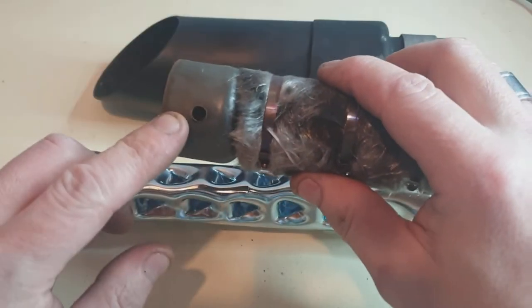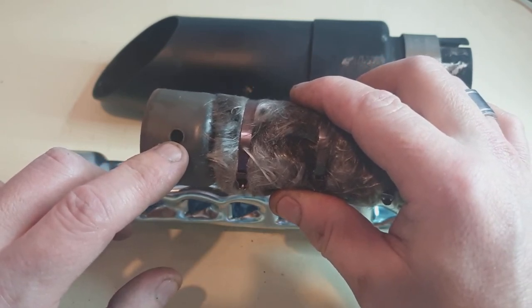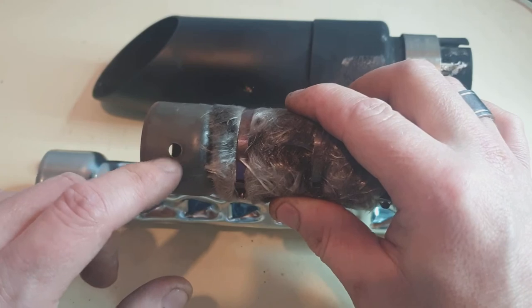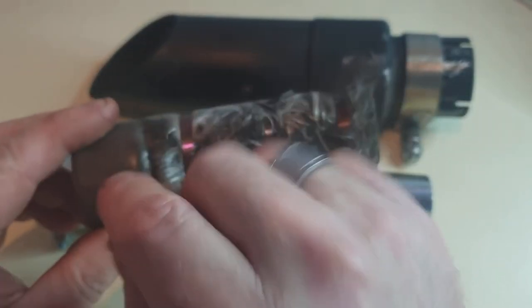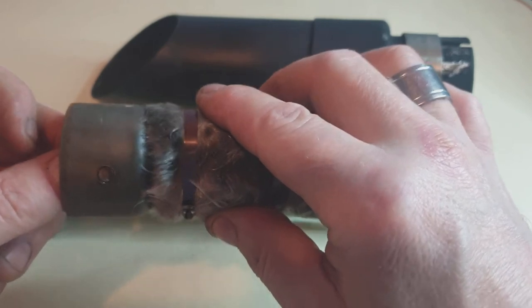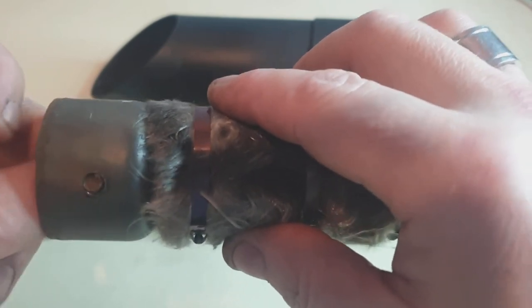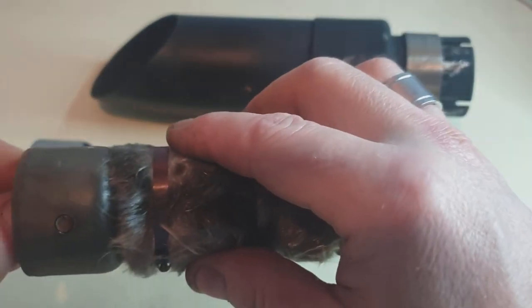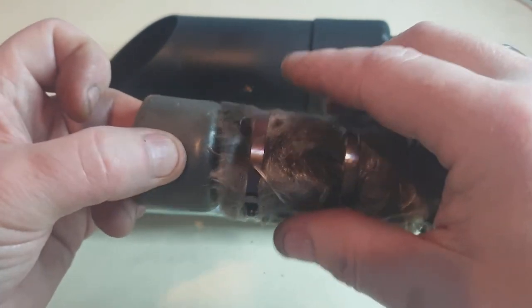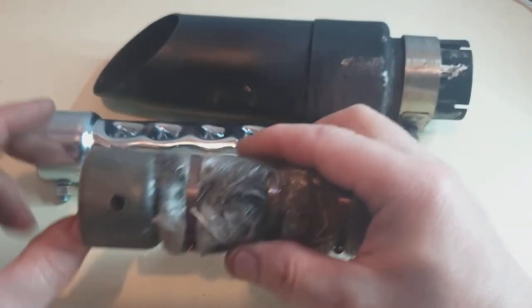So what I ended up doing was drilling another hole on the side — finding a drill bit just the right size so that when I put the bolt in, it actually bites into the hole and you can use it as a sort of thread. It makes it harder to do up, but that's what you want. When you stick the bolt through from the inside out, you turn it and feel it biting against the metal — put your bolt through, tighten it up, and that holds it against the wall of the Radiant Shorty and keeps it in place.